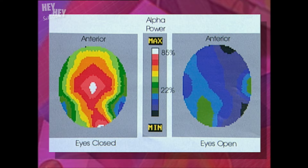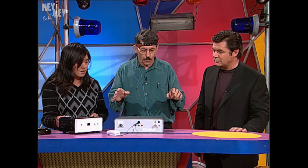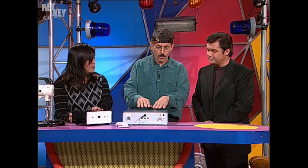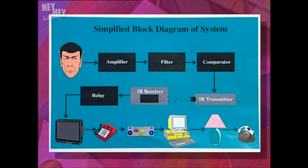There's something called alpha rhythm. When your eyes are open, there's normally not much at all — represented on a map with blue and purple colours meaning not much alpha activity. Alpha waves are slow, rhythmic waves. When you close your eyes, you get a sudden burst of activity represented by red and yellow. What we're going to try to do is see if I can use my alpha wave increase to switch on a whole lot of electrical gadgets. This gear was developed by the Mind Switch team at the University of Technology in Sydney — Yvonne's part of that team. It's an Australian world-first invention. When I close my eyes, there should be an increase in alpha activity, amplified by this grey box, filtered from background noise, and a message sent to this infrared machine. A message should be sent across that gap to trigger a relay, which will then switch off all these devices — but only my mind can switch it all off without any physical connection.